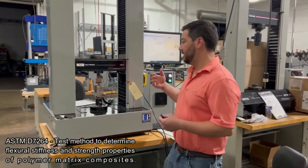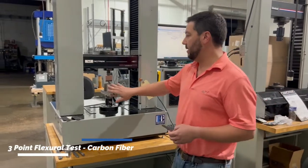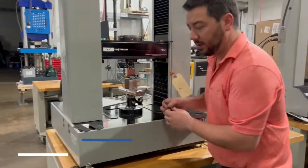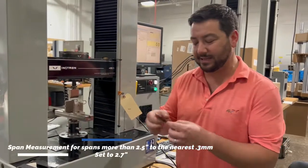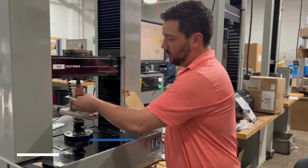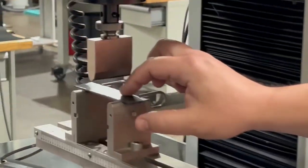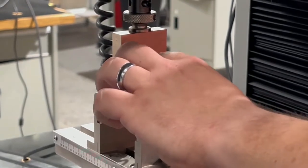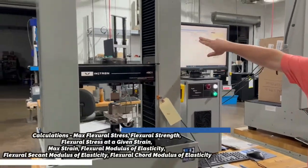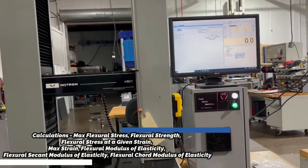Today at Frank Bacon Machinery we have a three-point flexural test that we're doing with carbon fiber specimens. Real easy to set up — we have a bend test fixture here with the loading nose and span support. You have a little bit of span measurement based on the thickness of the specimen, so we've set that for 2.7 inches. To load, we just put it up against these loading points to maintain center of the arms, then we want to center the specimen on the supports. At that point, I'm setting up my specimen identifier with all of my parameters for that specific specimen and pressing start.